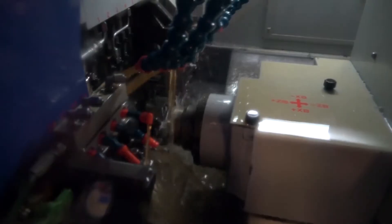We spend a lot of money on good quality machine tools because all we machine is stainless steel. A fixed head machine is quite expensive at the calibre we buy, which is a twin turret, twin spindle. With the sliding head option, we found we could buy a machine for less than half the price of one of those, and move some of the work they were doing onto that machine, also freeing up capacity on our fixed heads.